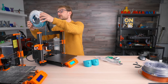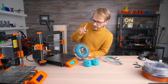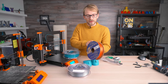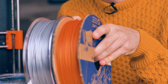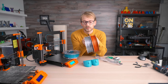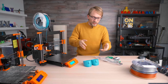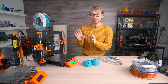Just in case you're wondering what filament we're using — I'm using Filamentum PLA, some sort of teal. I've been debating using the Filamentum silver or the Protopasta TOM, though those two have particles in them, so they'll naturally look better in print quality just because the glitter, even if it's just a slight effect, will hide some print imperfections. With the Filamentum PLA I can be sure it's a filament with no significant diameter inconsistencies, which could also be causing the Z-ripple artifact. I just know it's good filament.